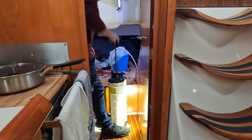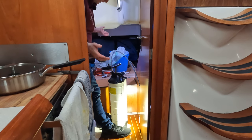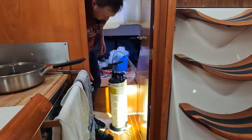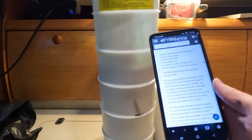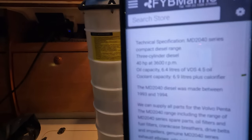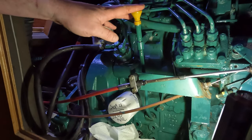Just a few pumps — and here it comes, it's coming up the tube now. Last time I just left it and it all basically did it for me. Each line represents a litre — this is four and a half litres. I'm a bit confused because the manual says oil capacity 6.4 and another spec says 4.5. That is about 4.5 and I can't get any more out. If anybody knows which way around it is, please let me know. Now put the oil dipstick back in and then I'm going to take the oil filter off.